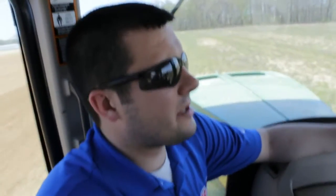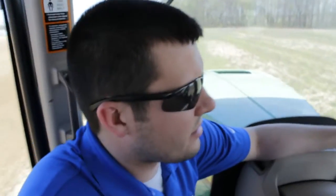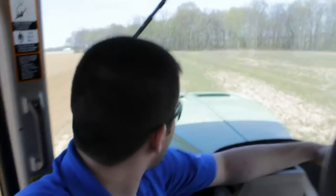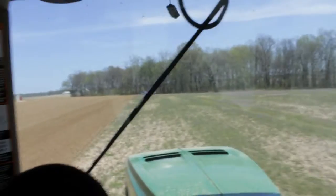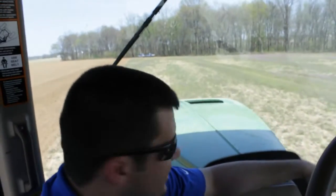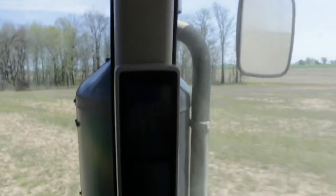We're down in the cab of the tractor. We've turned the module on stock and we're analyzing some of the characteristics of what we're seeing in the field. As you can tell, conditions are fairly dry down here — we've had minimal rain compared to the northern Midwest. We're pulling this VT tool about two and a half to three inches deep to do a nice seed bed preparation. It's leveling out nice. As you can see on our performance screen, we're at 1,950 RPMs, and it is turned down a little bit.